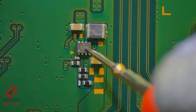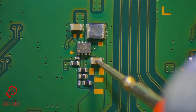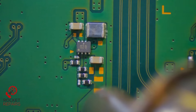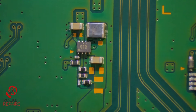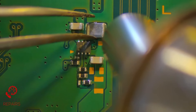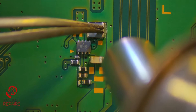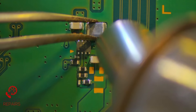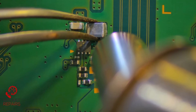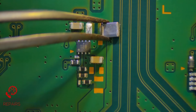The component generating the most heat is this one here. What I'm going to do is remove this and also remove this, just to see if that relieves the short. If that's the case, it would be absolutely fantastic. However, somehow I just don't think that's going to be the case. I'm going to start with the inductor at the top because that looks worse for wear. I could also inject voltage on either of these to see if anywhere else on the board is getting hot. I personally think this is the quicker alternative.